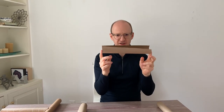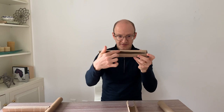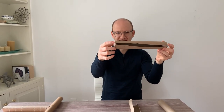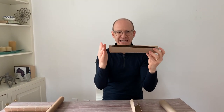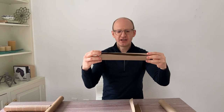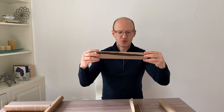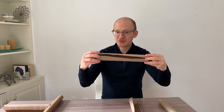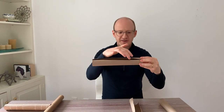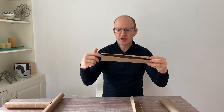So one option, if you have a situation like this — although it's not particularly great, but it's an option — is to take the sort of sliced open section, open those, but then only close the ends. You see this? I've kind of put sort of end caps, let's call it. So I can end cap at either end. And hopefully you can see as I'm putting some twist, about the same as I put into the previous open section, and it's doing better. Not great, because you can see some movement here, but better. The interesting thing is that this area down here is a little weak, and there are huge forces all kind of trying to go through the end.